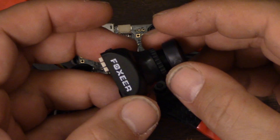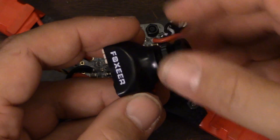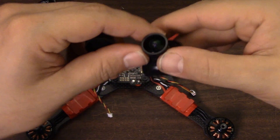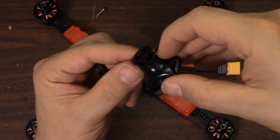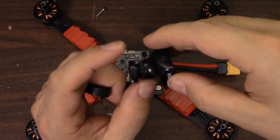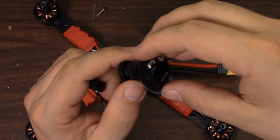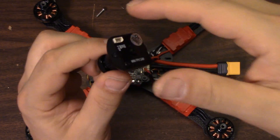We've got the camera here, and before I install it I should set it up. I'm going to take the lens out and replace it with the very nice GoPro style lens they sent. The 2.8mm lens has been removed and the GoPro style lens has been installed - it just screws out and screws back in again until it's focused. The other thing I do on these cameras is enable digital wide dynamic range. I find that enabling digital wide dynamic range makes the biggest difference; everything else is shades of gray.